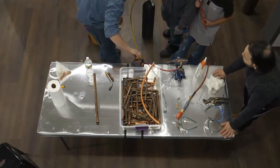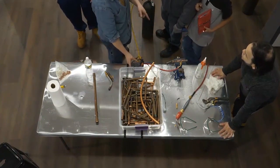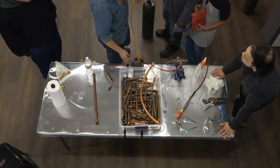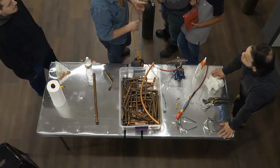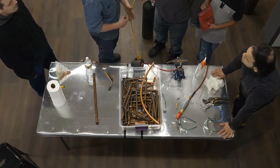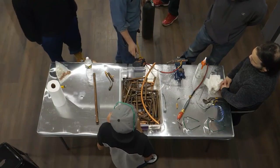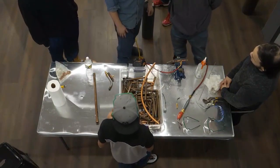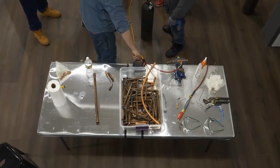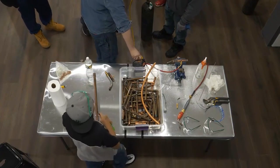For pressure testing — it depends on what you're testing for. If you're testing refrigerant piping for 410A, the highest that goes up to is about 450 PSI on a really hot day, so I would test 410A at 500 PSI. Right now we have 170 PSI inside. We're bringing it up — 490, 500 PSI.